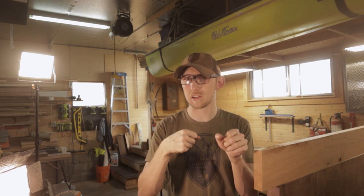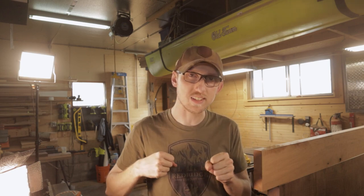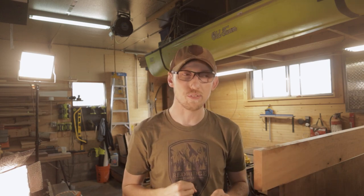One, I could go buy one of those little electric hand planers, so that at least saves me the physical effort of moving the hand plane around. So that's somewhat better. Plus, those are 3¼ inches wide versus my 2¼-inch low angle jack. So that's an extra inch per pass. That's an option.